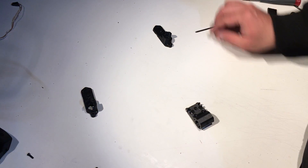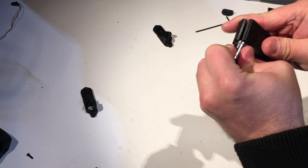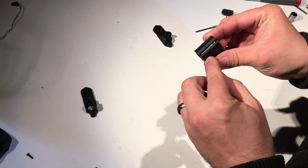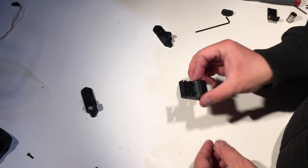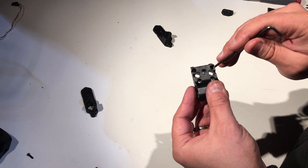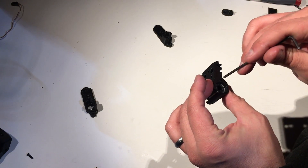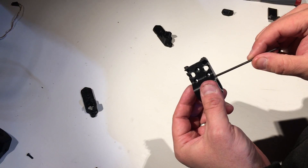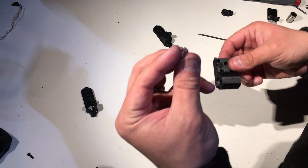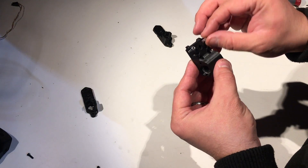So let's start with this piece right here. First thing you're going to do is take your regular LMU bearing and just push it in — it'll kind of click into place, and you want to make sure it's in the middle. Next thing you want to do is put a little bit of grease in the spring pockets to keep the springs lubricated and keep everything moving a little better. You can also put some grease in here, which is basically the pivot for the hot-end extruder. These springs have already been in here so they are covered in grease. Slide one spring in here, slide another in here.